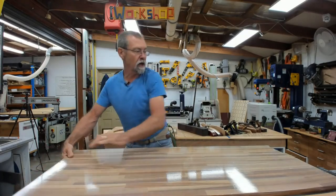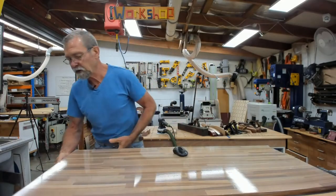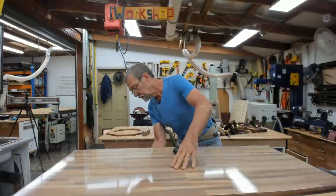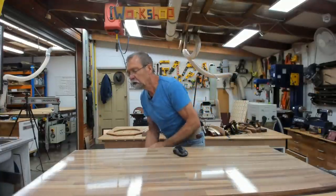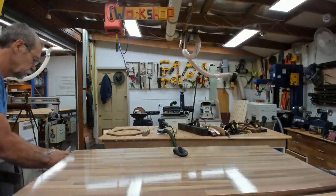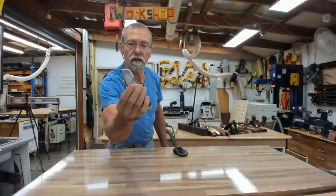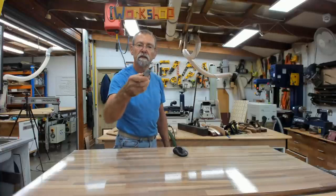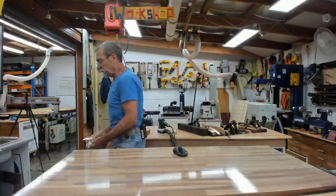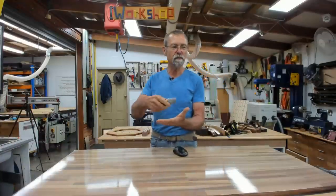That's starting to catch on there. I'll switch the cap. First of all, I've got to cut the end off this. That might end up being an issue for me if I don't. Where are we? Just going to whip the end of this contact off. Do you know you can sharpen the blades in these things? I've seen so many people, and I used to be one of them, that threw the blades away. Just a quick hone on an oil stone and away you go. The first time I saw that was a carpet layer, because they're using these all the time, and he just had an oil stone beside him going for it.